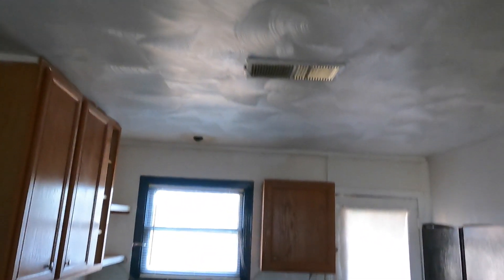We've got all the light fixtures removed and the doors are opening and closing freely now. As you can see, most of the light fixtures actually have boxes — electrical connections have to be made in an enclosure like this, unless the light fixture is rated for self-enclosure like some fluorescent fixtures. However, I noticed that this one on the wall and this ceiling fan did not have enclosures.